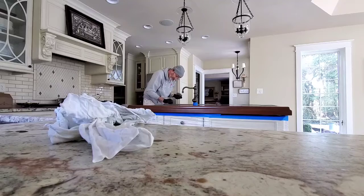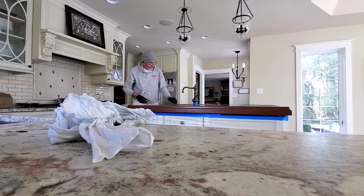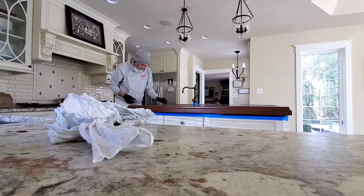Coming to the end here. I suggest going with the grain — I know when I scraped I would sometimes go against the grain, but that's doing it carefully. When it comes to steel wool you're actually putting scratches into the wood, so I don't want to go across the grain. You can't see it but this is turning up some dust up here, and it's real easy to knock that dust all over the place — don't make a mess.